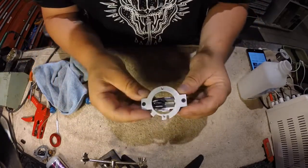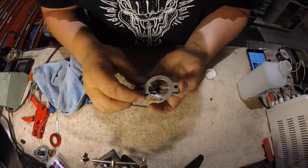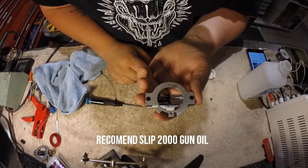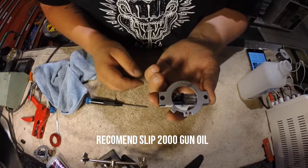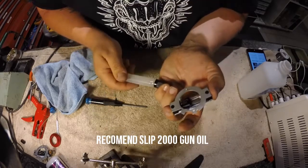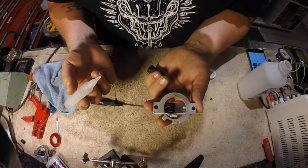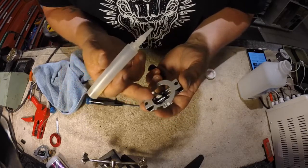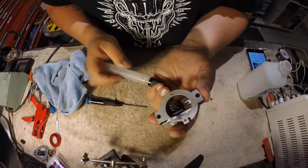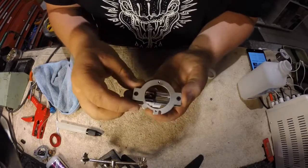Your fader is now taken apart, reassembled, and put back together — nice and smooth. If you need to add a lubricant, we recommend a very thin oil: a gun oil or machine oil such as for a sewing machine. We use a gun lubricant called Slip 2000 — it's silicone-based, available at most gun stores or online. Just put a drip or drop on each rail, then slide back and forth. Clean as can be.